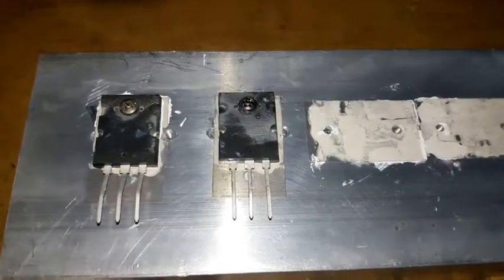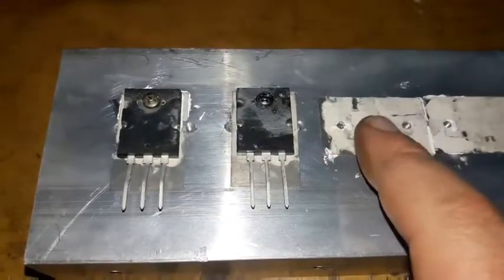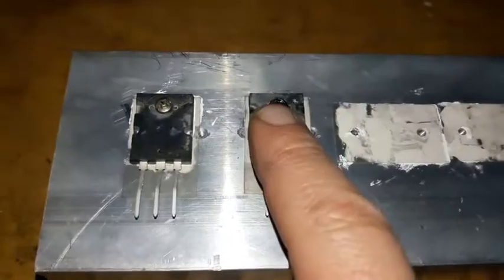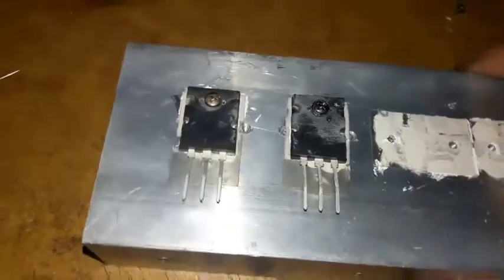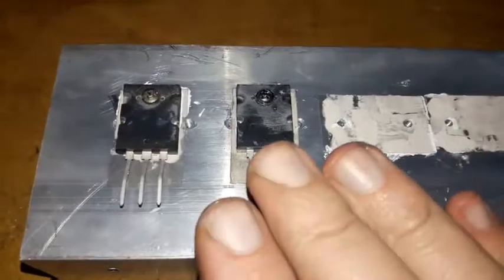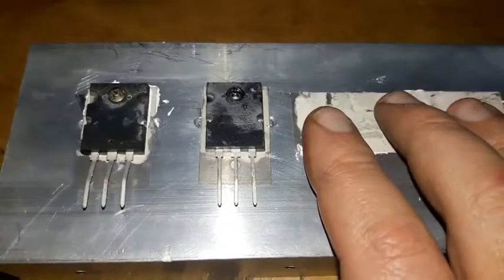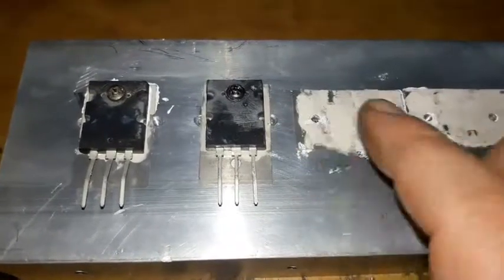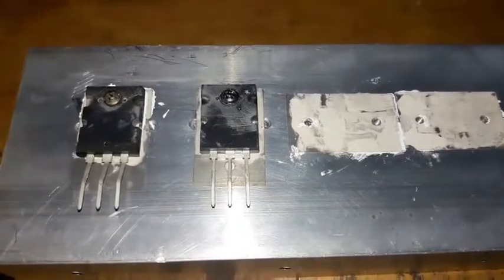Here's the cooler itself. The power transistor has been populated. Those model is not available with 2 screws on the side, but this model uses 1 screw, and I installed this one with a nut from the other side. So this one is ready. I'm going to install it, hook those two up and assemble them and screw the 2 screws that hold each one in its place, and install it and see what happens.